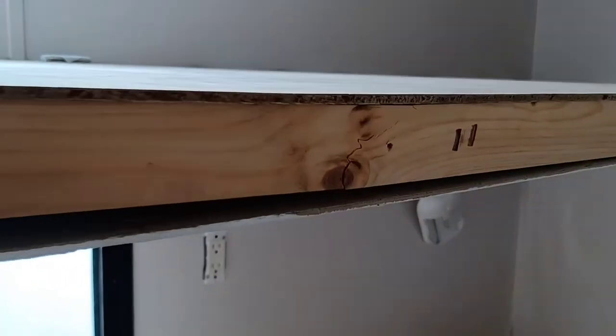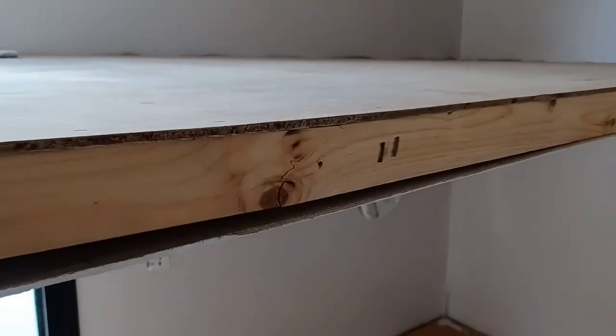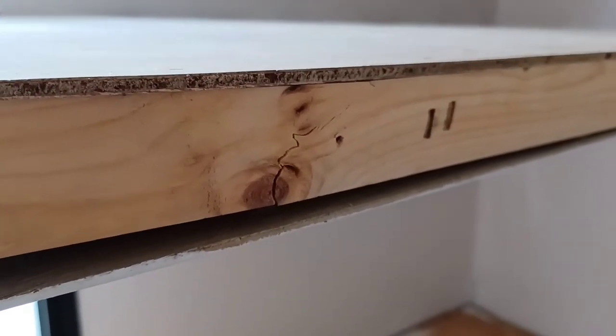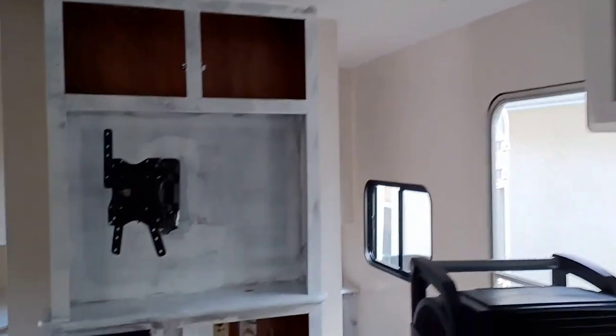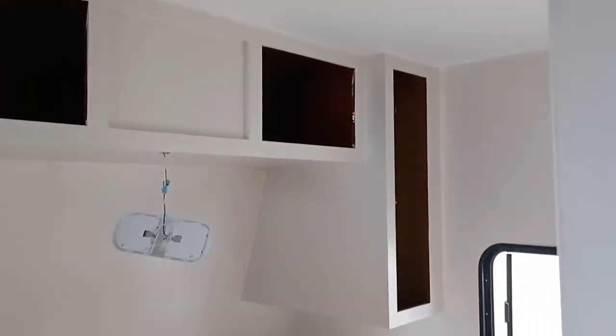I'll show you — this is it. That splinter in the wood sure gave me a fright. I don't think she's made for my weight limit, so another thing to add to the list. This is two coats of that Vanilla Steam color. I probably could have gotten away with just one coat because it covers really well, but I always do two coats just to make sure I'm not missing any little marks. I also chose to go with an interior satin paint. You could do a semi or high gloss for better wipeability, but definitely don't go any lower because as soon as you scuff it, it's going to leave a mark.